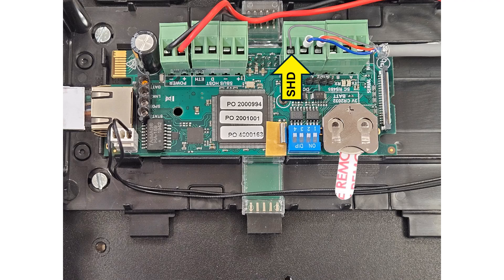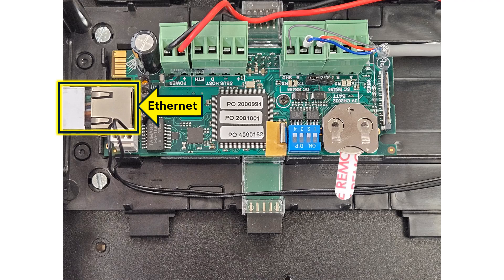This will minimize the effects of electromagnetic interference. Plug the Ethernet cable into the socket on the cluster controller and route it to a suitable Ethernet switch, with cable length no longer than 100 meters.